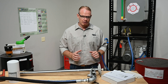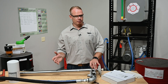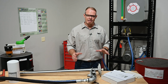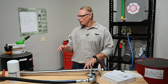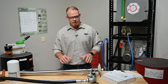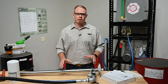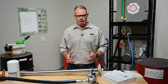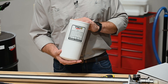We've selected Trico's drum pump filtration system to help us remove those contaminants and get us down to where we need to be. Because this oil is going into a gearbox application and we intend to keep it in the barrel itself, that's why we've picked this solution. We've also picked the recirculation kit from Trico, which comes with quick disconnects making changing from filtering to dispensing a whole lot easier. Because this is a gearbox application, we don't have to be as concerned about tolerances as we would with a hydraulic or bearing application, so we've selected a 10 micron filter.